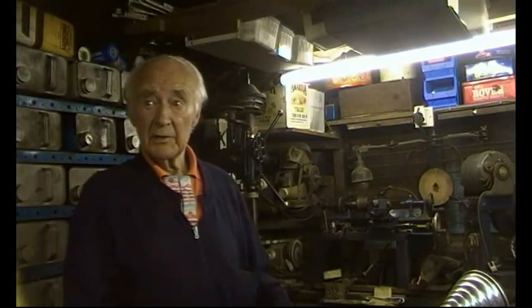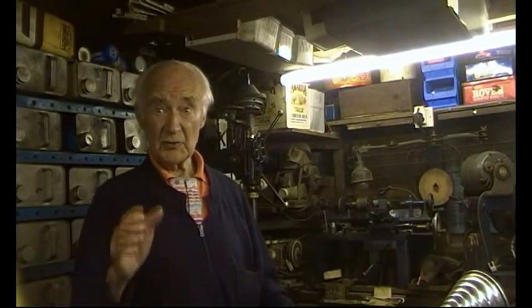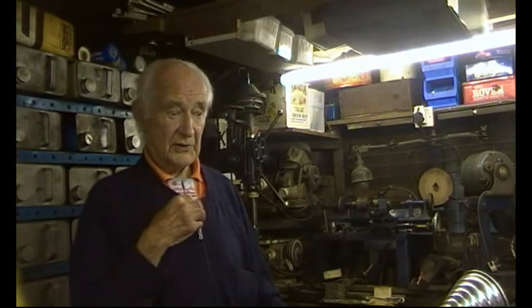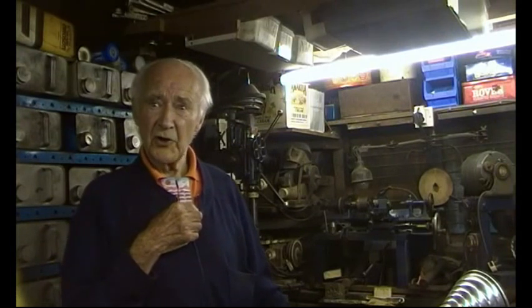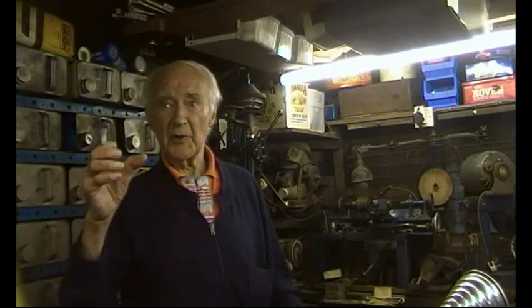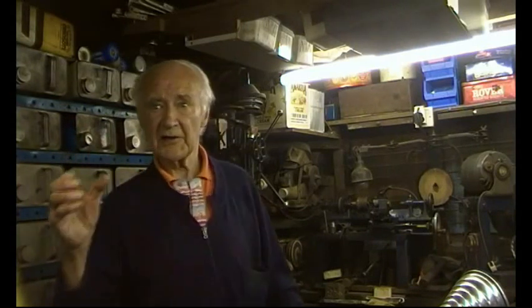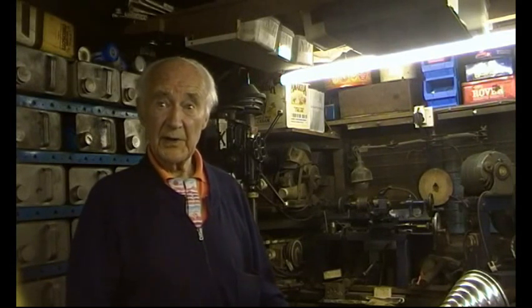Was there a lot of damage to some of the big power stations? No — the big ones were flat out, working on base load, they were all right. The smaller ones were working on an intermittent load. There's one particular power station I remember going to — there was some trouble with the economiser, all due to putting it on high load and taking it off load. The economiser was expanding and contracting, expanding and contracting, and it did some damage to it, so it had to be repaired.